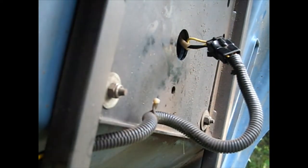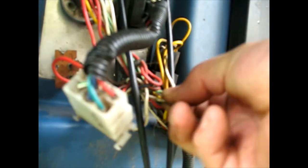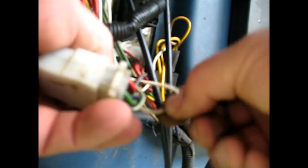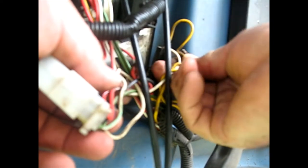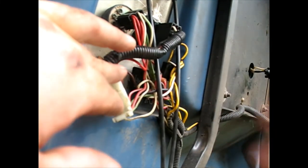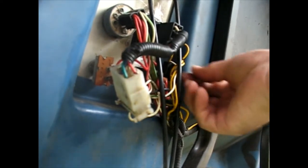I have suspicions Johnny Fix-It's been here before me. Still won't crank. I'm going to take that connector apart and check for continuity - just make sure that both of those plugs have continuity to each other through that wire. Yes - so when it's plugged in it will have continuity, which will give our power back to the yellow wire. The only other yellow wire coming back down goes to this relay. And what makes or breaks this relay, we'll have to find out.